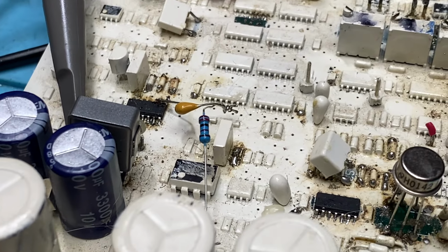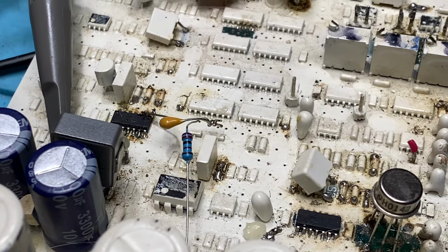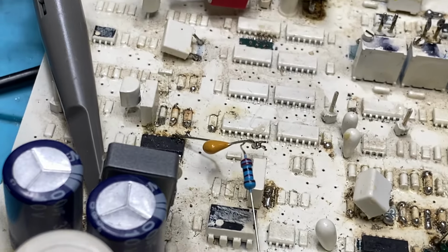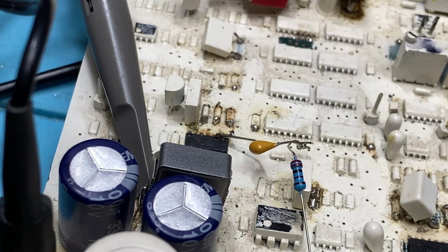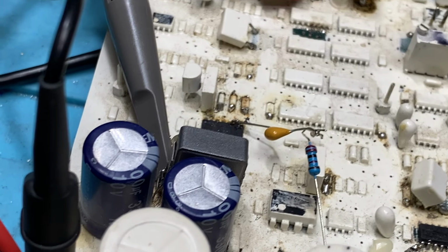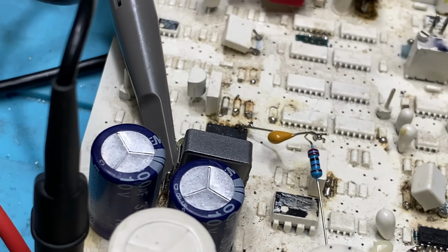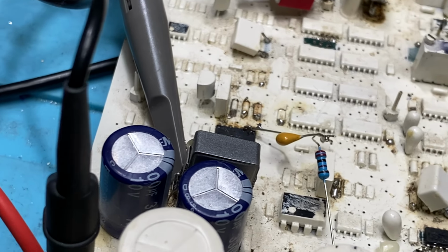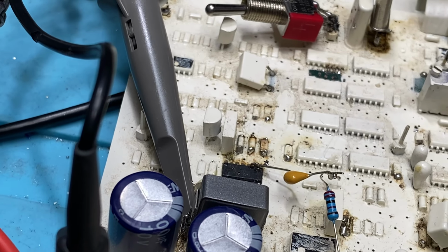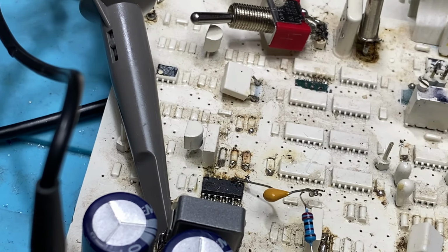I forgot there's a diode under there too. I've got to remember the diode there. I just can't see it because it's underneath the inductor I put in there. So, beefing up the inductor current-wise, because it does have to do a little bit more work when you're charging up these capacitors. The inrush current to those caps would be significant. So, beef up the inductor. It might be a good idea if you also beefed up the 2N7002 device, or the E-line in this case, whatever it is.